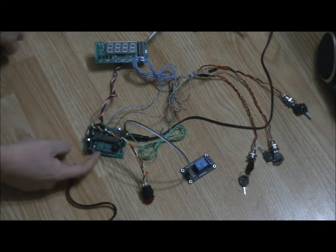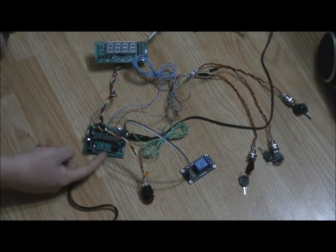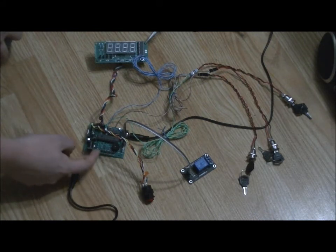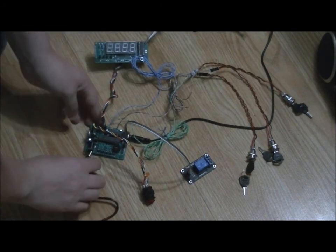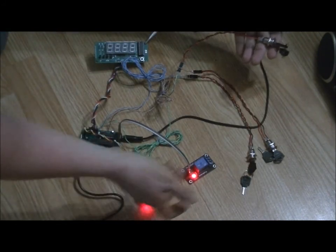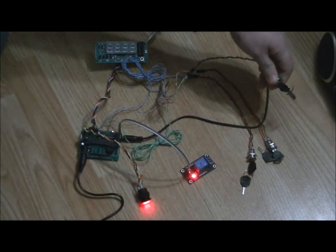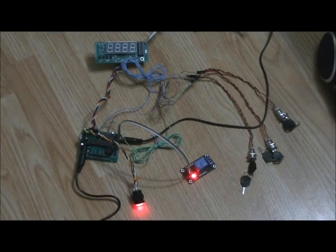There are three headers here, and the key wires are soldered to the bottom of the board — the leftmost, second from the left, and middle positions. Right now we've got blue, green, and brown. The green is in the middle, and if we turn that right on power-up it'll give us a 45-minute game. So I'll turn it right, press the red button, the unit says 'Turn all keys to the left,' I turn it left, press red to start — and the intro confirms: 'You have 45 minutes until the asteroid reaches minimum safe distance. Good luck and Godspeed.' There's your 45-minute game.